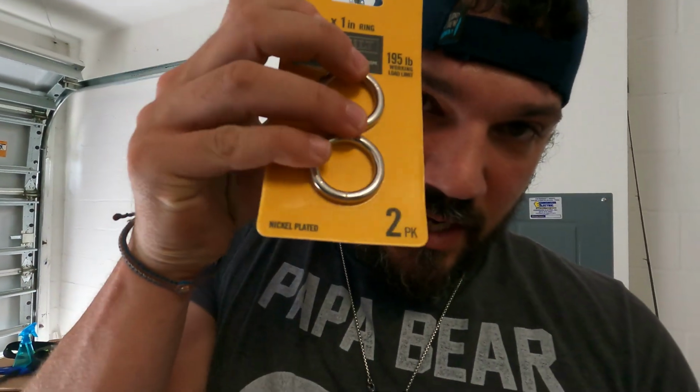And so the idea is, you've got this ring. We're going to tie one side of the rope on here, one side of the rope right there, anchor line at the bottom, and then we're going to thread the rope before we tie the anchor to that little ring right there. We're going to thread the rope through both pad eyes from front to back. I'm going to show you all this so that when I pull the line, I can move the anchor either to the front of the kayak or to the back of the kayak.